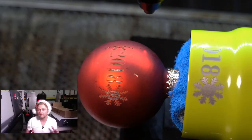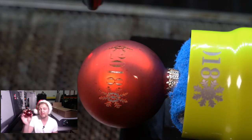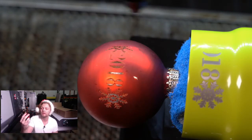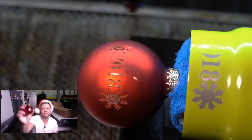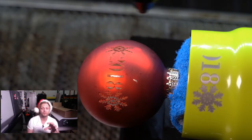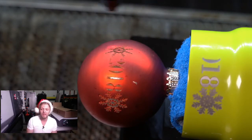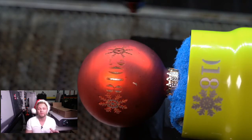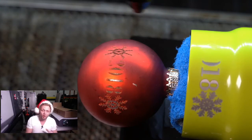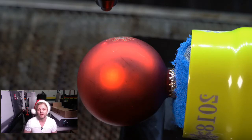Like all materials, not all bulbs are created equally. This guy ran at 12 power and 100 speed and it turned out amazing. Now this guy is completely different — it's actually a matte finish — and with the same power settings, you can see the difference. That's true along all materials; just a slight difference can change everything. So we're going to do a double pass on this guy.